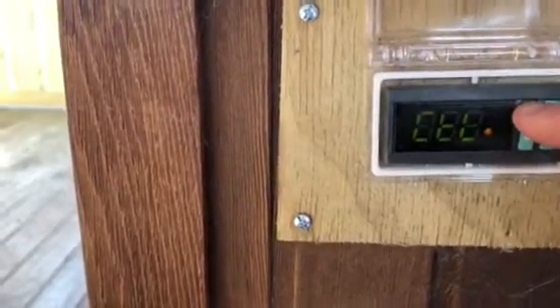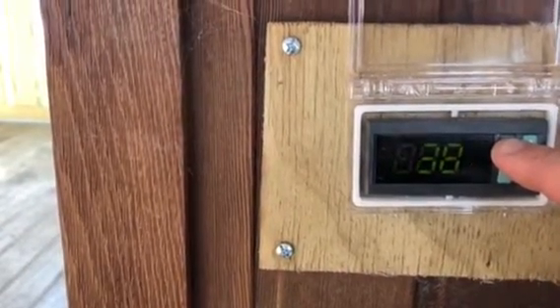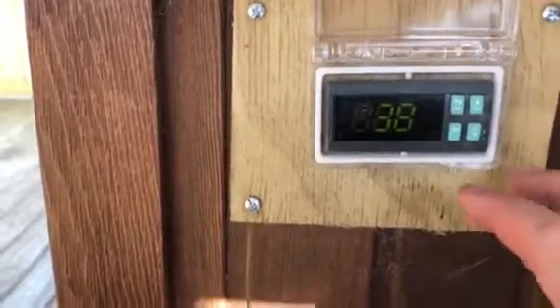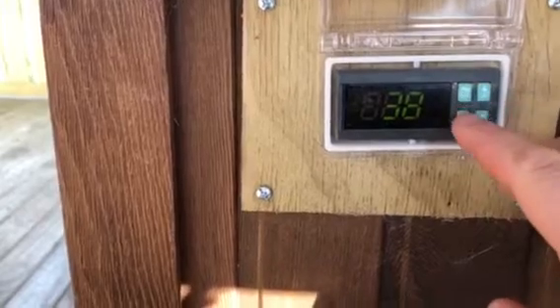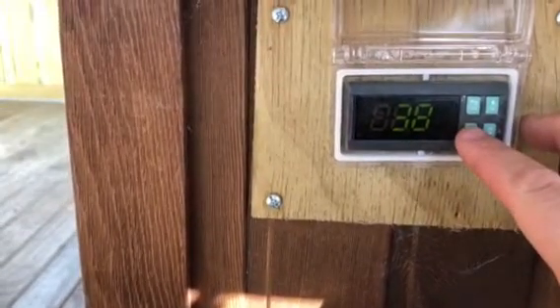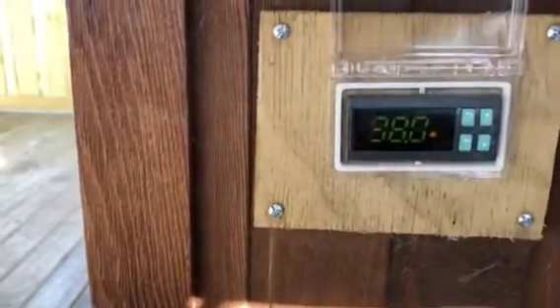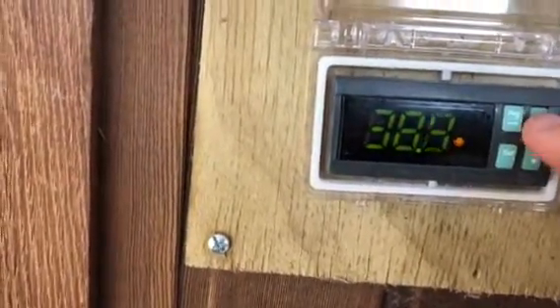Press Set and that's all the settings done. Hold down Program until it clicks out. So now it's at 38 degrees. The set point is 38.0 — remember we set up 0.5 of a degree as the differential. So in theory if the current temperature is at 38.5 it probably won't fire up.